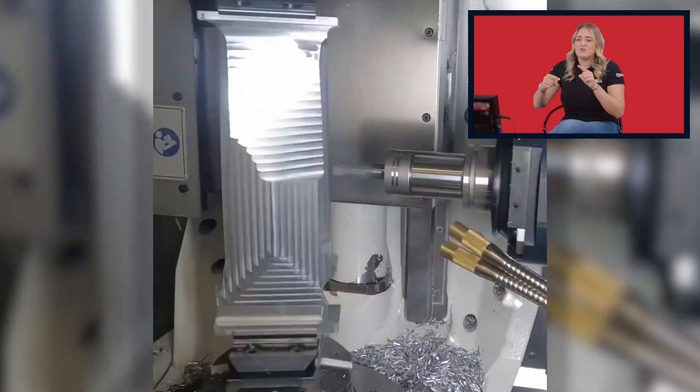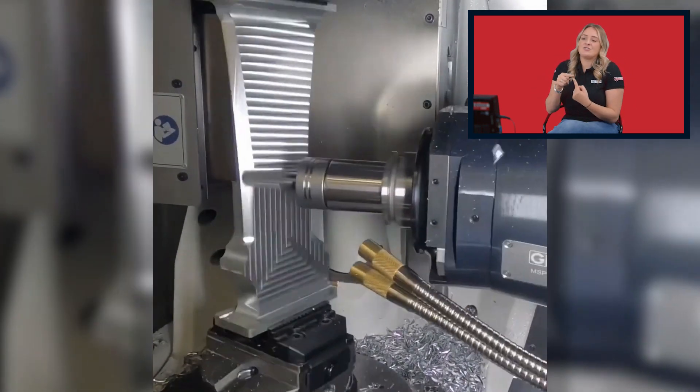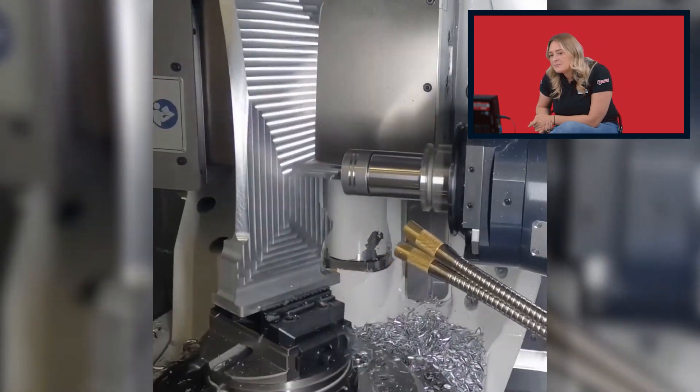That's quick, isn't it? Even the way it spins round — the tool is tracking the movements of its spinning so it doesn't lose any time. It's so synchronized, it's just unreal. But you see the two vices, so obviously it's driven. If I'm right, please tell me if I'm wrong — that isn't just driven by one with the other one free-floating. It's actually driven on both sides. It's got to be. It keeps it perfectly accurate. Because what you might get is a bit of distortion, and if that's moving round as well, the weight of the material might — if the top one's got no clamping force on it, you won't have your brakes on because you need to constantly keep it moving — it might start to jitter. So they need to be in sync, like you would have on a lathe: you need both chucks concentric to each other so you don't get any differential between the two.